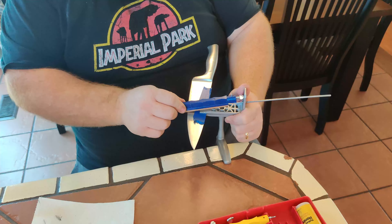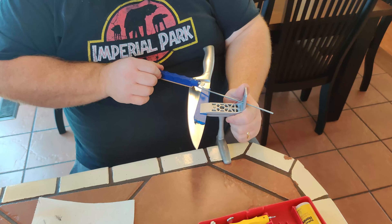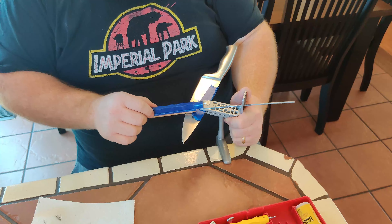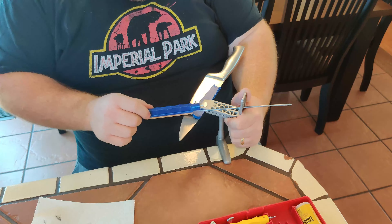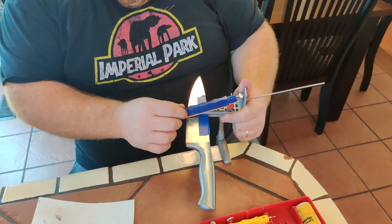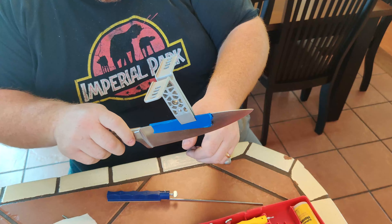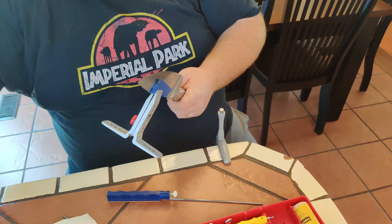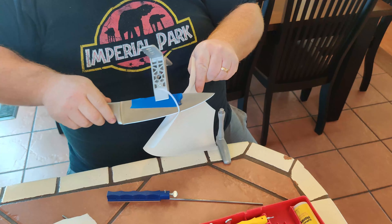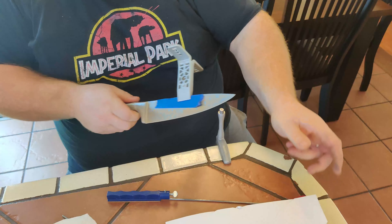With this one you want to maintain really light pressure. This is just honing — this isn't shaping, this isn't cutting hardly at all. This is just trying to move that burr to the other side of the blade. And if there are any imperfections left, they're little. I finished this side. It feels pretty good, it's got a good bite. And it should do this pretty well — look at that, it's just smooth all the way to the edge, which is good.